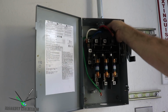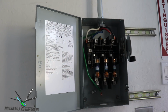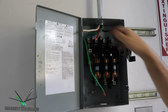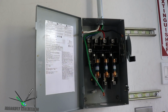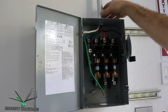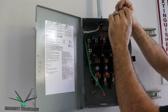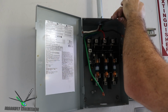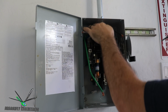This little plastic cap here that I'm taking off is an abrasion resistant cap. This plastic edge here is an added level of protection for your wires, because here it can kind of rub on this steel and cause problems. So now what I'm going to do is loosen this captive nut for the conduit clamp, and basically get the screwdriver blade onto the tip of this kind of thin nut here, and I hit it with my thumb, or with my palm, and then you can see how it loosened.